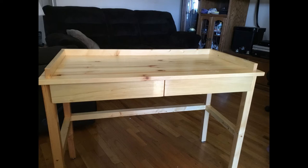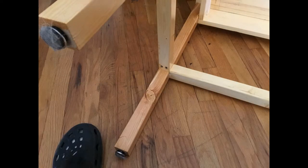The screws that are there are like what you would think would be a Kreg screw. They're on an angle, but I didn't use the device. I just drill them on an angle myself. And they're underneath the three 2x2s that go around attaching the legs. The screws are up underneath. The screw in the front is a dowel. It's literally a dowel, just for decoration, and it keeps it in line. That is the only other visible means of attachment other than screws, and you'll see those as they come up here.